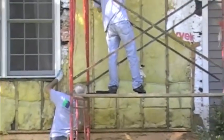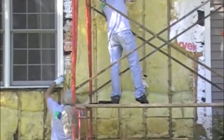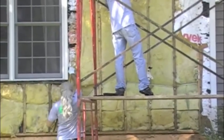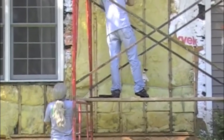Okay, now some of the Celotex foam sheathing has been removed. You can see a little section of the Tyvek house wrap that was there on the right, and you can see the exposed insulation. Alright, insulation has been removed. We're looking at the blind side of the gypsum wallboard. You can see the mold growth. You can actually see the damage, and you can see into the home.